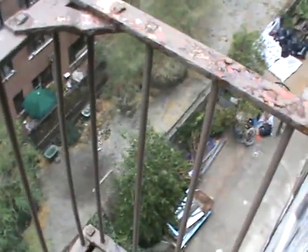Okay, 6 going down to 5. We got cement issues. So again, always repair with cement, then caulk afterwards. If we have some major problems with the cement going to the building, it may involve a mason. It may be beyond our repair order.